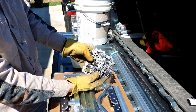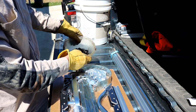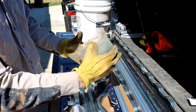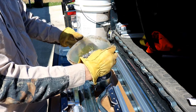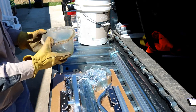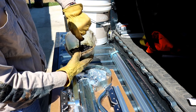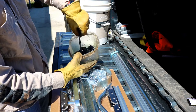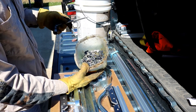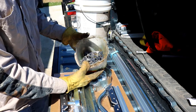Just a tip: when you put on a new chain, if you soak it in bar oil or motor oil, it gets oil all in your chain. Just something that you might want to try — I did it on my last one and it seems to work. You can never have too much oil, so I'm going to let this soak while I'm getting this built. This is bar oil — some people use motor oil, and probably for this, motor oil would be okay. But I personally wouldn't put motor oil in my chainsaw because you've got all that carbon that's going to build up. But let me know your thoughts on it.